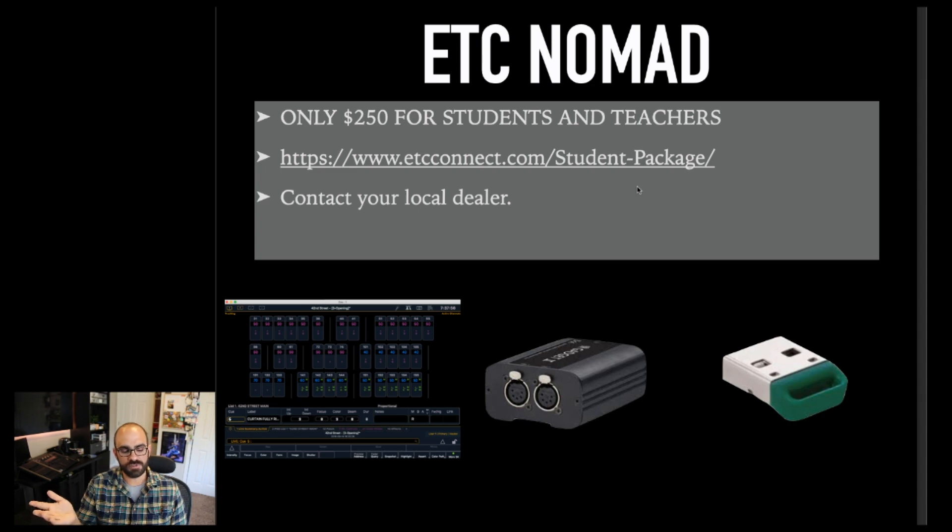You wouldn't want to use it as a backup to, say, an EOS because you're going to be limited to two universes worth of output. There are also other packages — I don't know if any other student packages quite exist at this level, but I think ChamSys has a free version. Brett gave me a dongle at LDI this year that I think is one universe or unlimited, but it only works for a couple of hours. So no matter what your console of choice is, there's something that exists. Nomad keys also unlock Hog software now, so you can get two universes worth of Hog 4 output just by having this little device. And Nomad also outputs over a network — you can do streaming ACN, you can do Art-Net, all of that over a network without needing the gadget device.